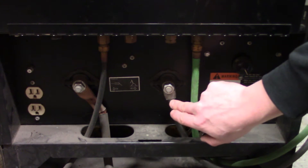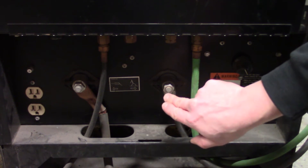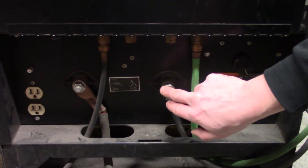This terminal here is where you put your electrode lead into. If there's a TIG lead on it, which we already took off, you have to remove it. Don't put both leads on there — when you activate your stick, it's going to turn the TIG torch on too, and you can lose shielding gas, short out the machine, and start a fire.